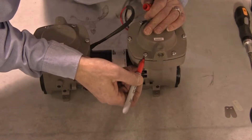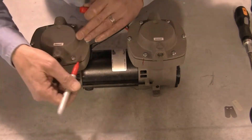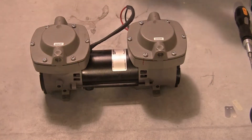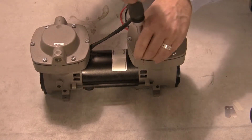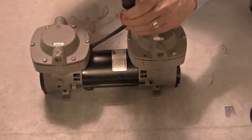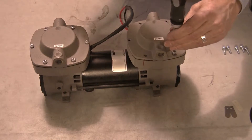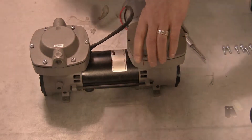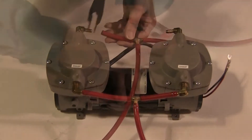Using the marker or tape, mark the orientation of the pump heads with the pump body for reassembly. Using the T25 Torx driver or the 1/4 inch flat blade screwdriver, remove the head screws and lift off the pump head. In most cases, this pump can be rebuilt without removing it from the mounting location. Disconnect any hoses that are attached to the pump, noting their location for correct reassembly.